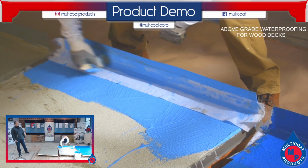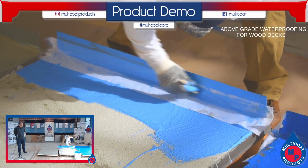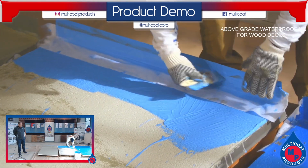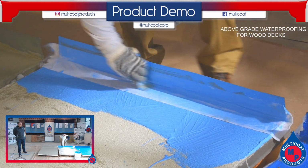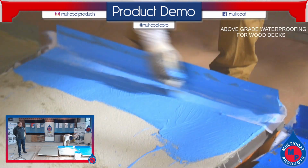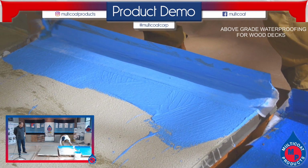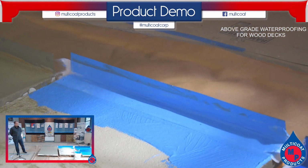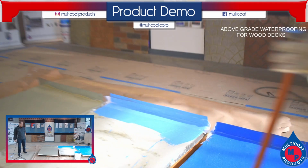You don't need to caulk, like if your flashing has a bunch of screw holes and stuff, you don't need to caulk them. You just go over it with Multicoat. Alfonso's doing this with a paintbrush. A lot of guys will use a small roller out in the field. And then once you do that, the deck is ready for its first coat of Multicoat.